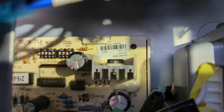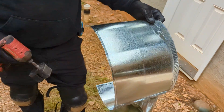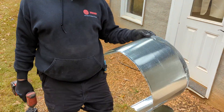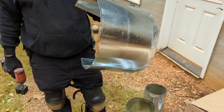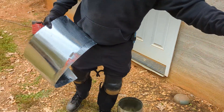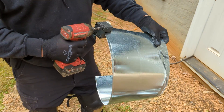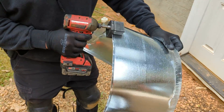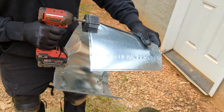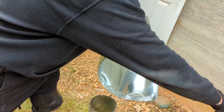They're starting to build the plenum. They're building couplings and putting some flex duct together, because there are some short runs that need to be extended around to the return plenum. They just cut a piece of pipe and are making them neat. Then the Malco tool crimps it up — cover your ears! I've never seen that tool before. It was nice on the ears compared to the mechanical hand crimper, which takes forever.